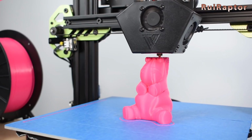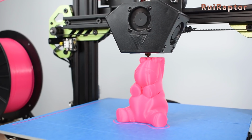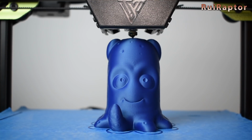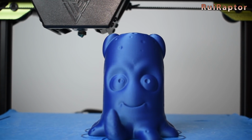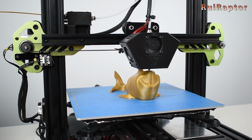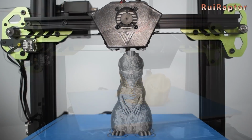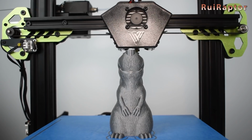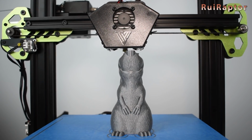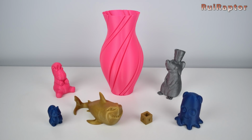You still need to check the hot end assembly and fix the nozzle and heat break installation. I explained this in detail in another video, so I really recommend you to see it and follow it. The link is down below in the description. If you don't do it, you might see your extruder skip and eventually get a clog. Anyway, setting up the profile on this type of hot end is a bit different. Depending on your filament, you might need to increase the temperature a few degrees or might see your extruder skipping or clicking randomly during the prints.